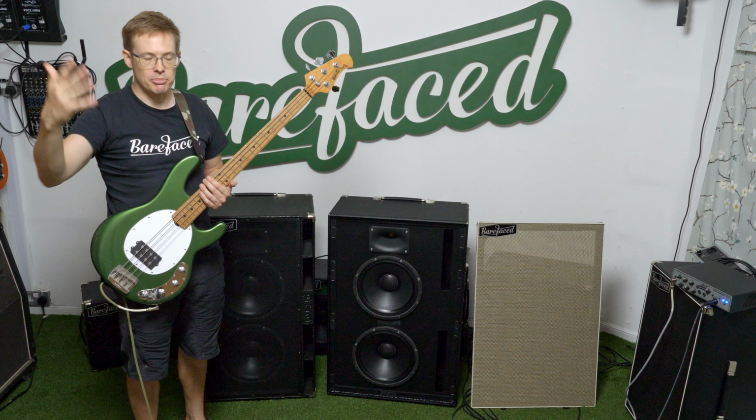With it all the way off, you can get these woofers to run to 10 kilohertz if you crank the highs, because the dust cap output runs to there. Otherwise the cones roll off at about 4 kilohertz and they cross over beautifully with this in the few kilohertz region depending on where you've got the knob set on the back. This crossover has protection, so it's essentially impossible to blow the tweeter, which is critical when you're doing the sort of things that I'll be doing with this, and many of the people who use them. It's also got constant directivity horn correction to ensure that the highs spread and fill the room with enough energy. It's quite a complex waveguide.